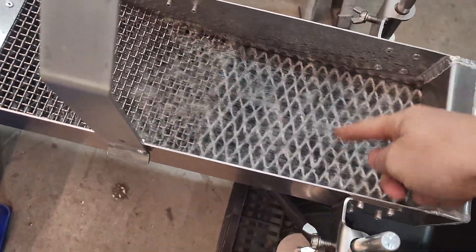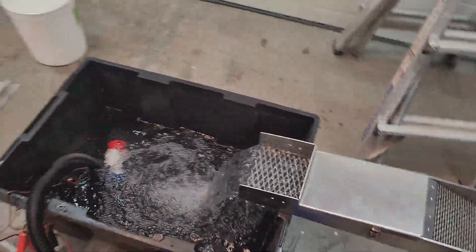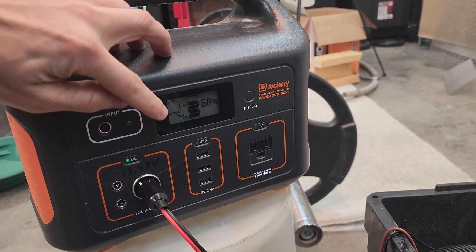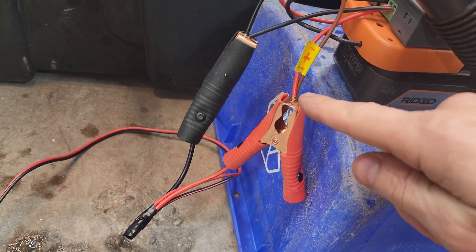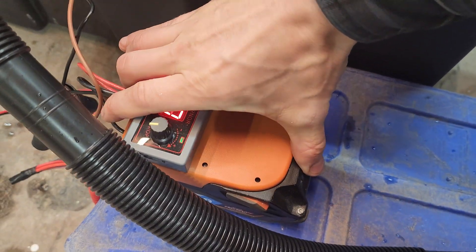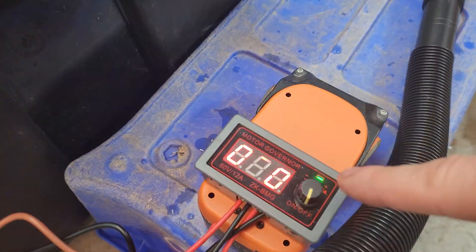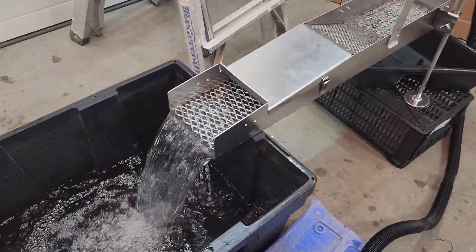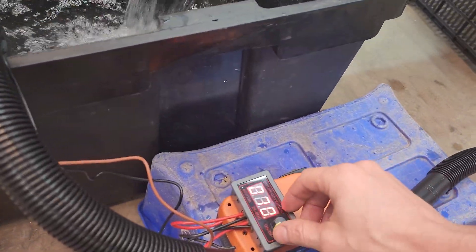A little bit quick right up here at the top, but as soon as everything gets classified in your sluice, things are running pretty nice right down here. This is showing me the watts used right here — it shows 74. When I did my previous test, this was showing 73. I've just temporarily connected negative to negative and positive to positive using these clamps. That's not connected to anything and this is my 18 volt tool battery. When I engage that, it's running at 70% — so that looks pretty much identical.